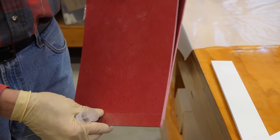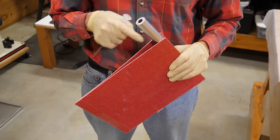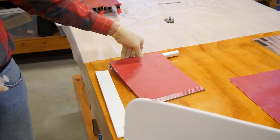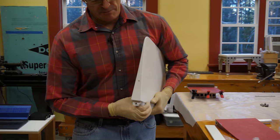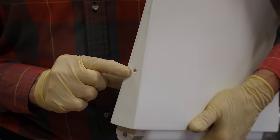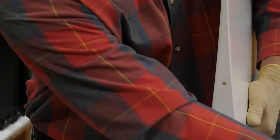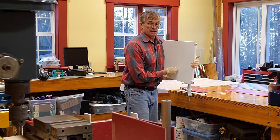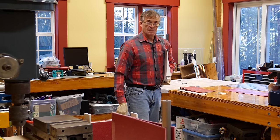Once this has been cured, you're going to ask how do you get this one filled — obviously there's no way to pour it in. What I did on the rudder is if you look at the bottom, I simply took a drill and a pipe tap — a tapered tap — and a tiny little plastic plug. I drilled this out, tapped it, and then using the same syringe, I injected the epoxy in here, filled up the lower surface, and then when everything was hardened, just screwed the plug in below the surface and it looks nice.